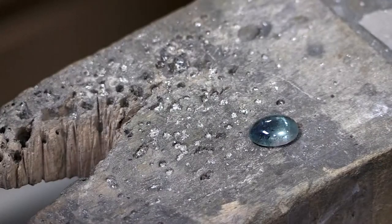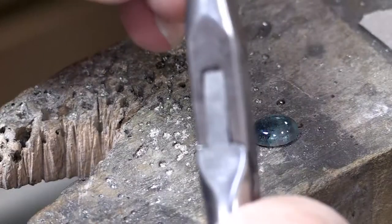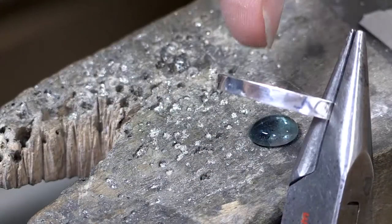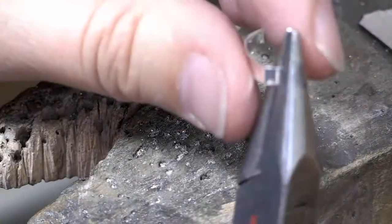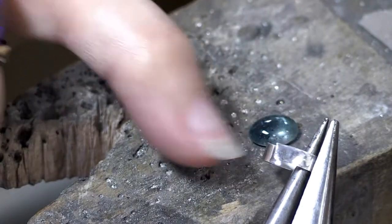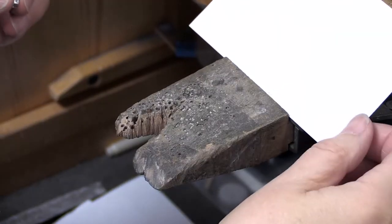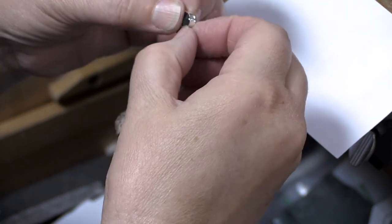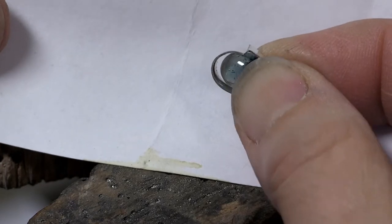All sterling silver. The first thing I would do is take some half round pliers - you want a plier that has a flat and a round so that you don't put more tool marks into something than you need to. Put the curving jaw where you're going to curve your metal. We'll kind of curve it around. There's a bit of a flare or taper to these so you want to make sure you don't put a taper into your bezel. I've got that wall slanting a little bit - I'm going to have to correct that. Use a piece of white paper or card to look against and it will give you a good profile.